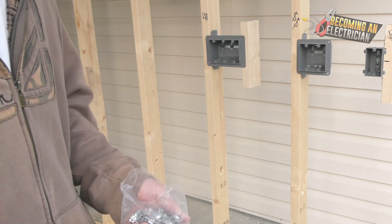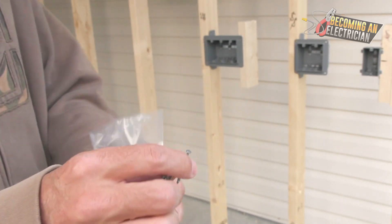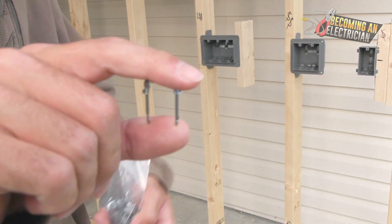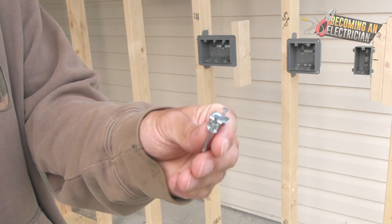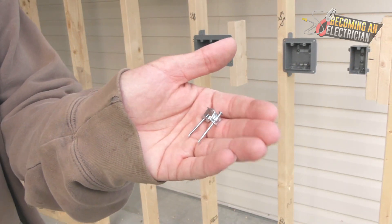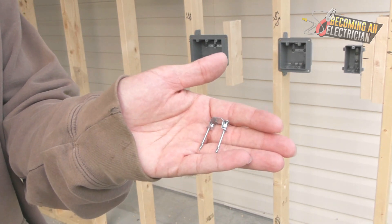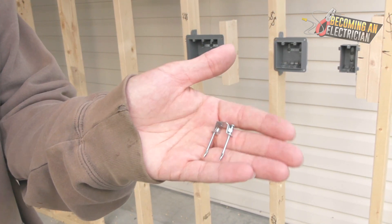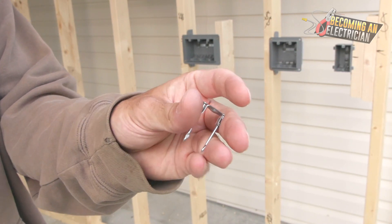Personally I like these metal staples. The plastic ones are good too — a little more expensive — but these are my favorites. Code rules are changing now; you can't put two wires under the same staple anymore. People were hitting the staple too hard and it was causing house fires over time. There are new stackable staples now where the wires clip in, but here in Canada, Home Depot doesn't even carry them yet, which is strange given it's a new code requirement.